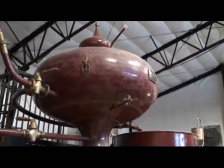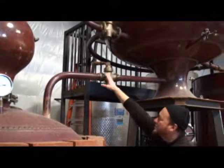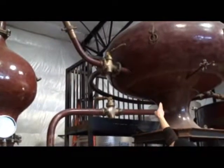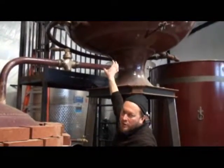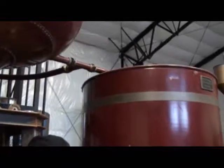This is the pipe that empties the preheater down into the kettle for your next run. The top pipe can either go through the preheater, or you can bypass and go around the preheater if you don't want to use the preheater, or if the liquid in the preheater has hit the temperature that you want and you don't want it to go higher.